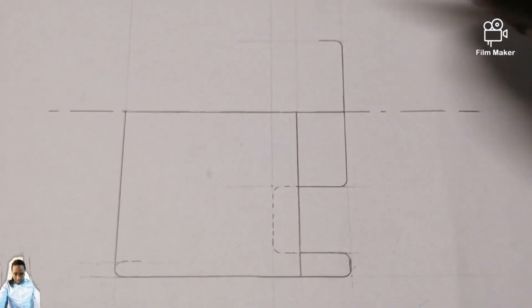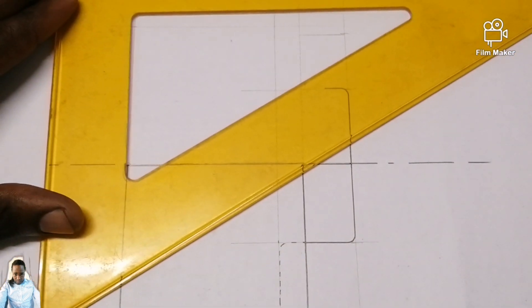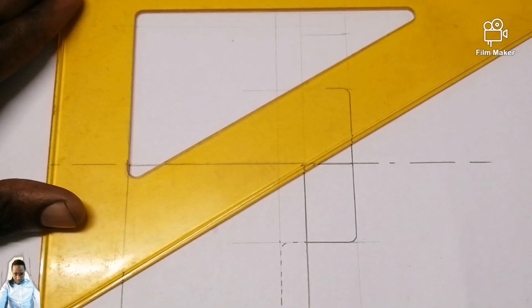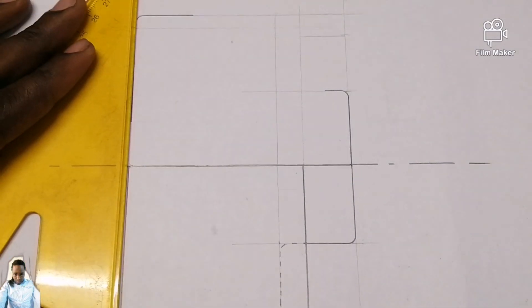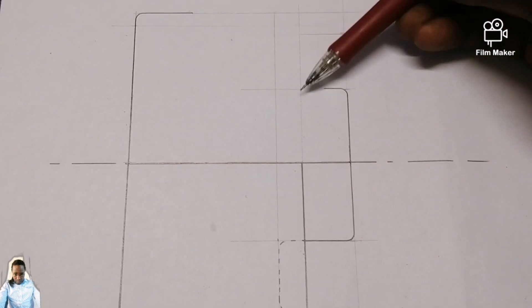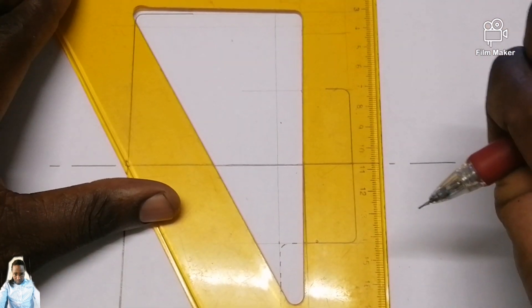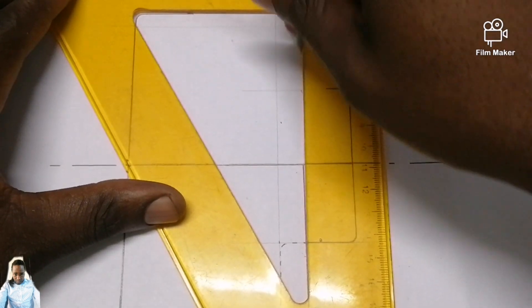So what you did here you can do it up there again. From there, the dashed line - you can do it up there as well. Remember we are drawing item one. This one can be further extended dashed until - remember that it's half sectional with the top half in section. So I am going to draw it there. Which means here it's going to go in - that is 12 millimeters from here till here. 12 millimeters, so now this one you can further extend it just a little bit.